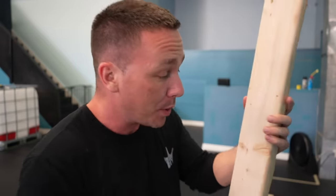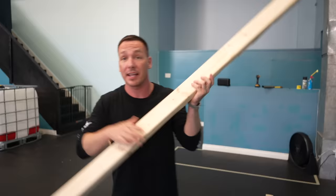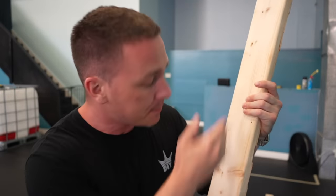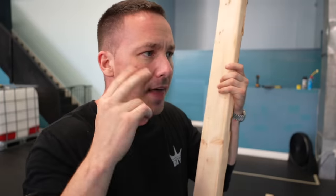I'm actually pretty cheap. I try to save money all the time at whatever I can, including when I look at a piece of lumber like this — a 2x4 that's 8 feet long, 96 inches. How many pieces of wood can I get out of this to get the least amount of waste? There are really only four different dimensions when building a stand: the length, the width, the uprights, and the supports. We only have to measure four things when building your own stand.